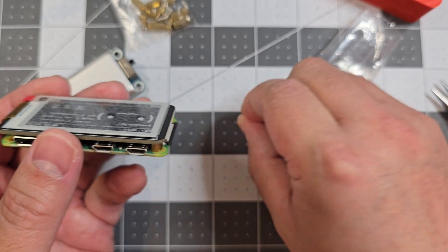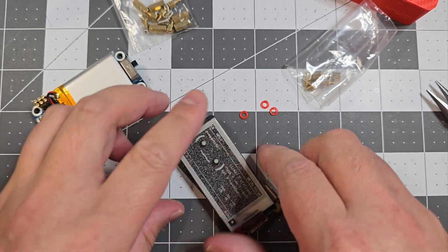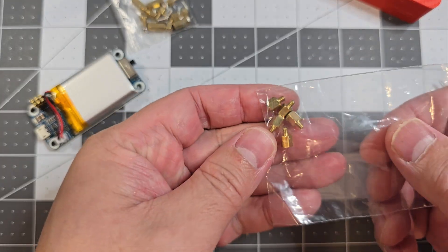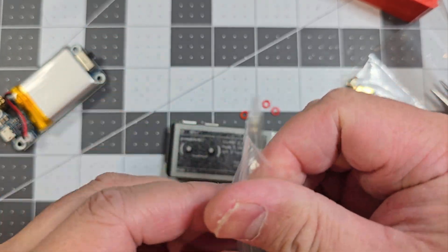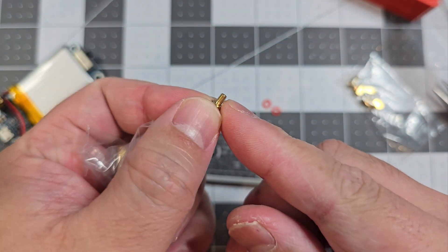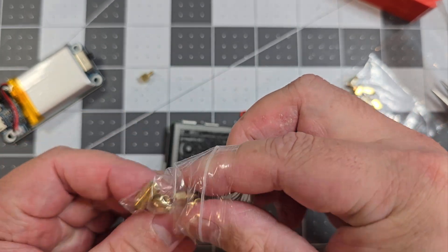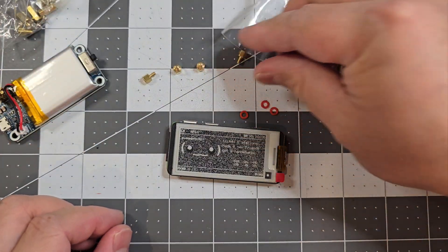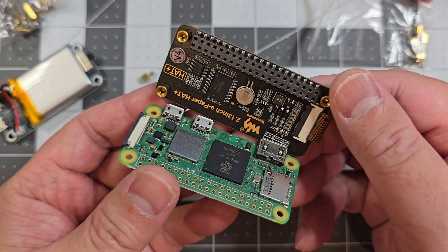To overcome that with the Raspberry Pi 2W, what I've done is I've just printed some 0.75mm spacers to go in between. We'll use the mounting points from the UPS because the screws are actually a bit longer. You should get four of those out, noting that on the hat there's only three mounting points.